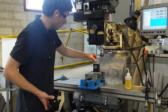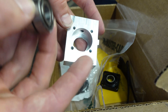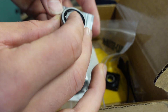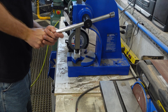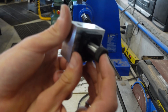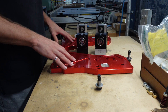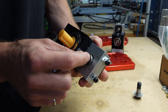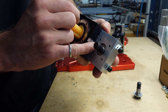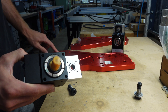I just machined this slot into the gearbox housing, one of them. The diameter of these bearings is larger by a few hundredths of a millimeter than this bore, so I'm going to press it in there with a big arbor press. Swing arms — I'm going to be putting them on here. The inner ring seats against the inside ring of the angular contact bearing, which will distribute the load onto the face of the Y-gantry plate.